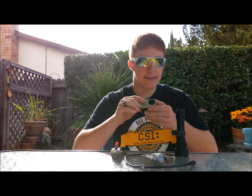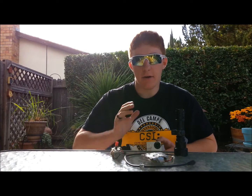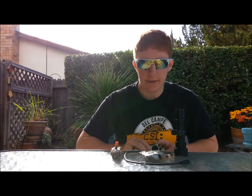What that piece is, it's just a piece of glass or polymer that has a metallic, reflective property. It's pink, and it doesn't allow infrared light to come through. So if I took the infrared filter out of my camera right now, you would be seeing this image in pink. Instead of bright, vibrant colors, you would see pink, vibrant colors, and everything would have a pink hue to it. If you take it out, it makes it IR sensitive and allows that infrared light to be visible.